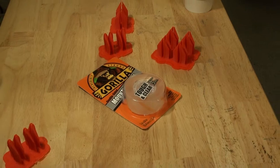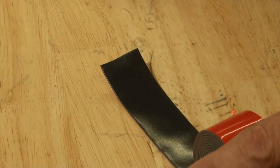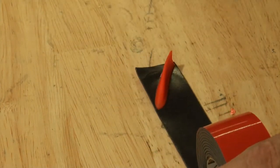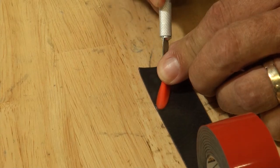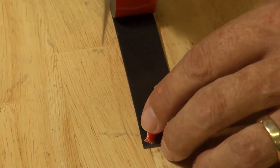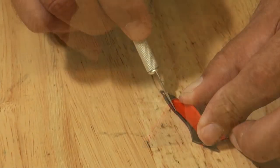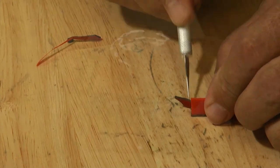In this series of videos, we've been experimenting with the use of commercial-grade double-sided mounting tape. The process is really quite simple. We simply roll out a section of the double-sided tape and place the Vortex Generator base onto the sticky side of the tape. We then take an X-Acto knife and trim the double-sided tape to the Vortex Generator profile. Ensure that you do not allow your fingers to come in contact with either surface, as the oils on your hands can degrade the adhesive properties.